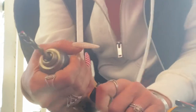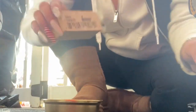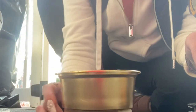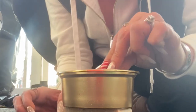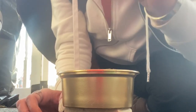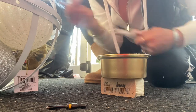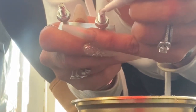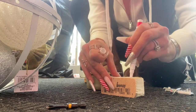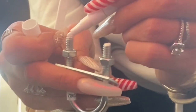I'm going to put it the opposite direction and lock it. I'm taking a little piece of wood just to have something sturdy to drill into. I should probably mark where the holes are going to go — I'll show you a little trick for that. I got a paint marker — this is a trick from the sign shop I used to work at. I'm going to draw on the little edges right here. Make sure you have plenty of paint on the edge so it makes the marking — you want it fully saturated.